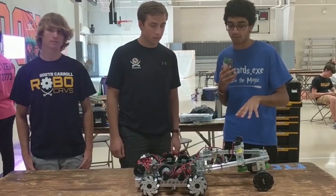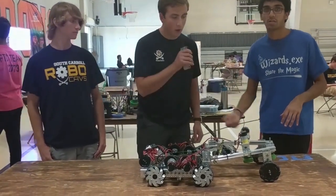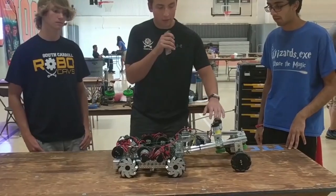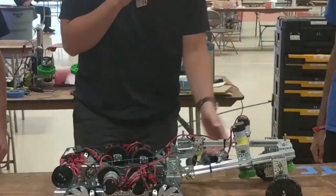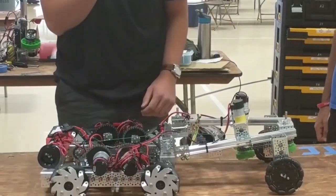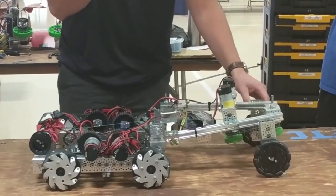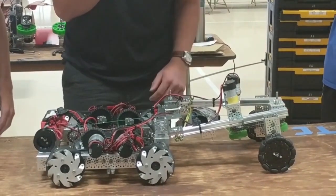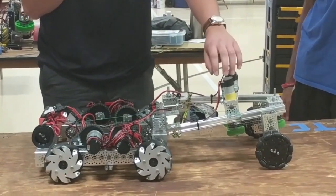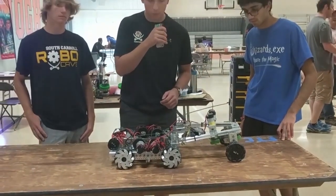Now the coolest thing on the robot has been their intake. So we started this year wanting a really fast design, so we have this foldable intake that starts at the beginning of the match up like this. We'll drop it down right before tele-op, and then to pick up stones we just have this flexible intake. We have the anti-mar compliant wheels and then a 13 to 1 motor here. It's proved to be a really fast collection mechanism.